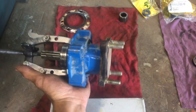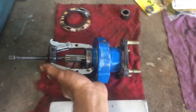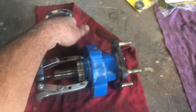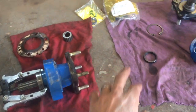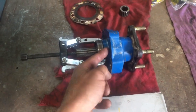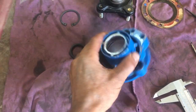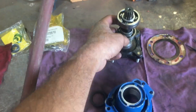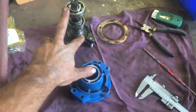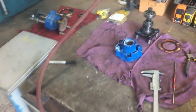These are the stub axle assemblies. This one's the left-hand side that has an extra sliding gear as part of the diff locking mechanism, and that one is still waiting to be pulled apart. There are two bearings, a circlip, and the oil seal that I want to replace is right in there. Here's the one that I've already pulled - it presses in from the back into the shoulder, followed by a bearing, and then the shaft, and a spacer, and another bearing, and there's a circlip in there somewhere. This is the one that was leaking. We're going to do them both since it's a bit of a hassle to get in here, and it's an opportunity to do the oil change as well.